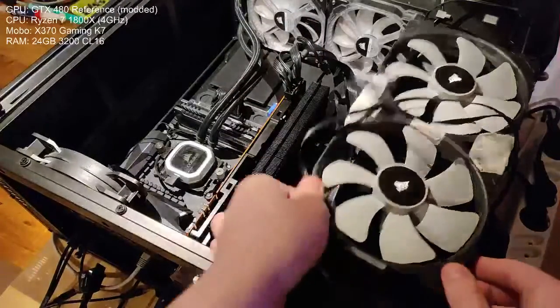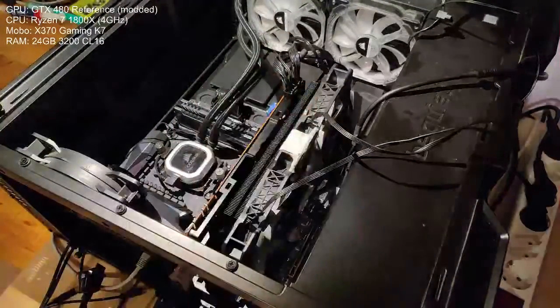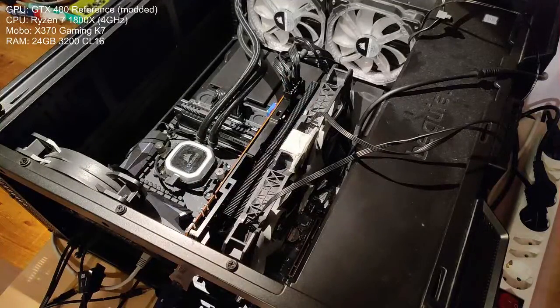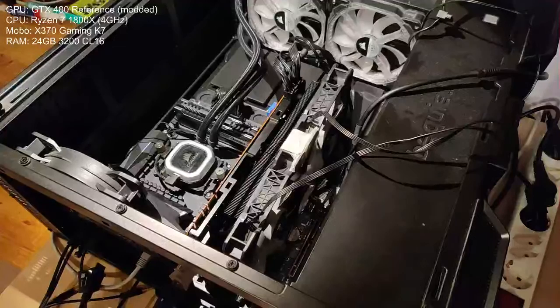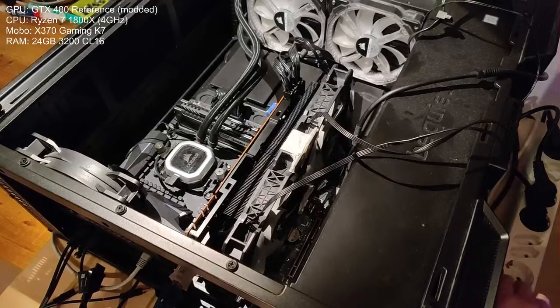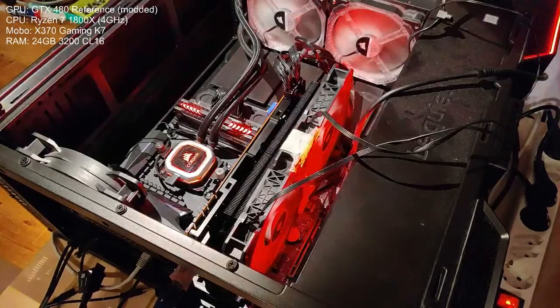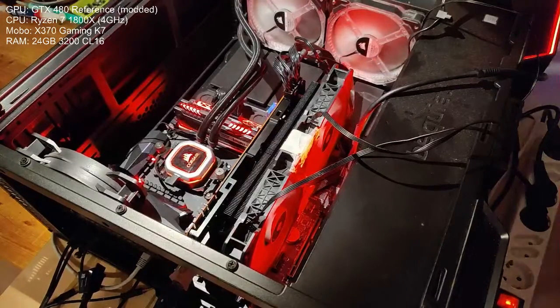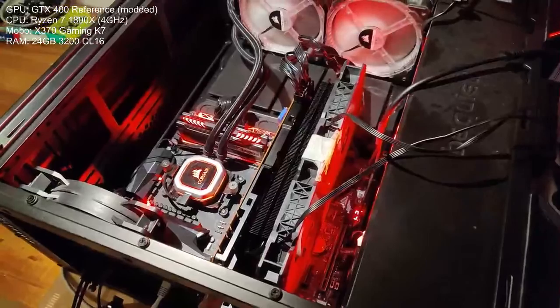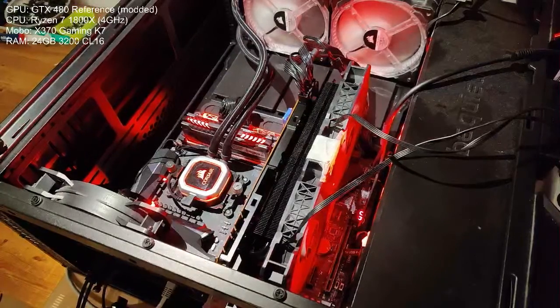Okay, we take our fans. These are slightly too big, these are 140 millimeters. The heatsink is made for 120s. I do not have good 120s, so these will have to do. I did a test run for thermals and it is fine. So yeah, but having 120 millimeter fans would be a better idea. So let's try to boot this thing up. You can't see the postcode. Can you? There's a cable in front of it. We have B2, we have 98, we have boot. Okay, I'm gonna set the camera back to the screen, so see you in a minute.